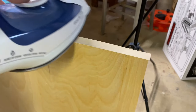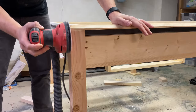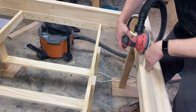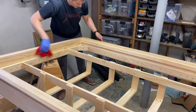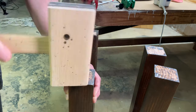To clean the edges I used some veneer — I've covered veneering in the past so I'll leave a link in the description below. The table is up on four legs, so we're going to sand with some 320-grit, wipe it down with tack cloth, and then a damp rag to perk up the grain. And then it's staining time. Now that all is dry, let's add some leg levelers and take this bad boy home.